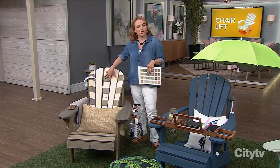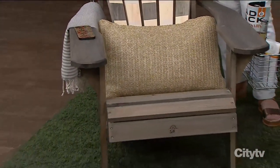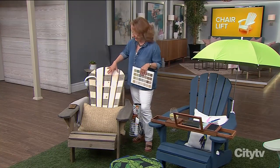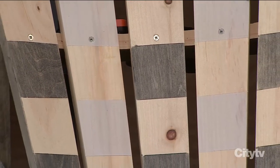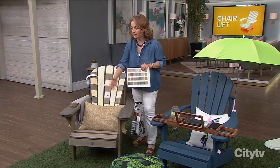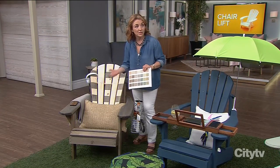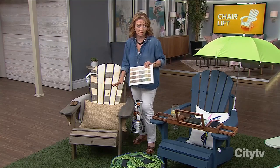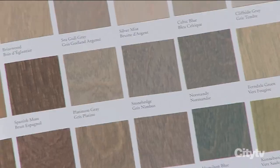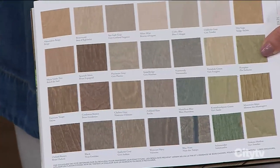With the first one — I was inspired by my daughter's gingham shirt — it's a little bit of a Canadiana theme. I used the natural wood as one of the three colors you traditionally see in a gingham pattern. I also used a semi-transparent black, to really enhance the natural wood, and a semi-solid white. The cool thing with the semi-transparent is it does emphasize the natural wood, so you do want to give it a good sanding before you use semi-transparent, so it's as blotch-free as possible. Pine is a softer wood, so it's going to be blotchy. This is actually a brand new card from Benjamin Moore with wood paper on it, so I'm excited how similar my stain color looks compared to the reality.